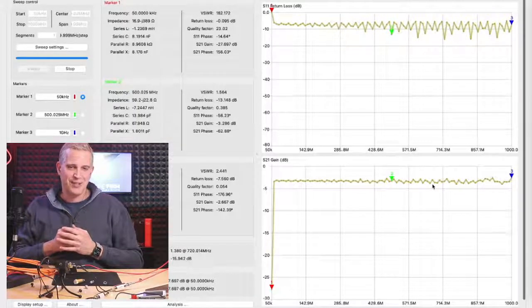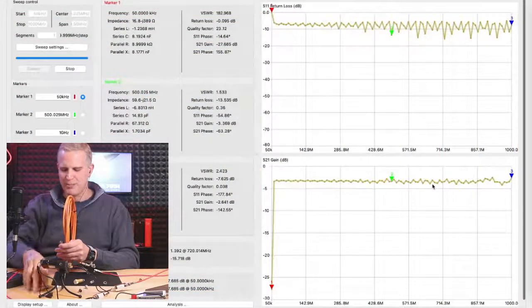It's much tighter. Yeah. So one of the things that we can do, like using PNM, is you can count basically the wavelength, or how many of those standing waves there are, and you can estimate the length of this coax cable that's attached. But getting back to best practices, the way that you can make that standing wave go away and fix that really bad return loss that you're seeing, remember, when the return loss is really bad, that cable modem is going to be losing energy. We have micro-reflections. Just terminate everything.